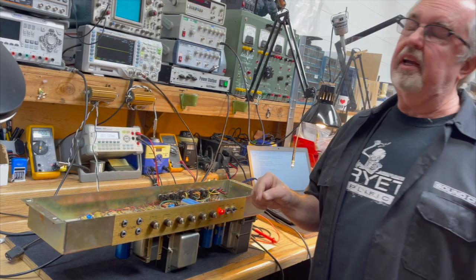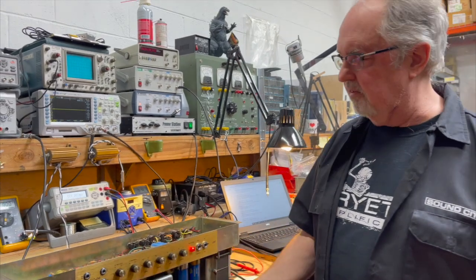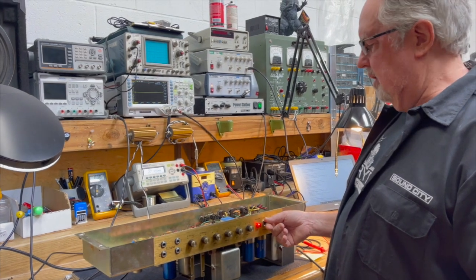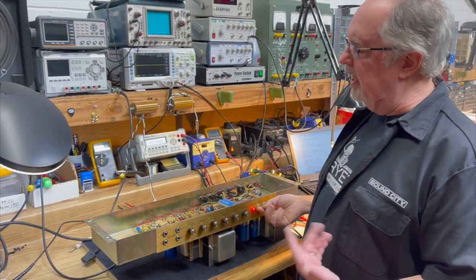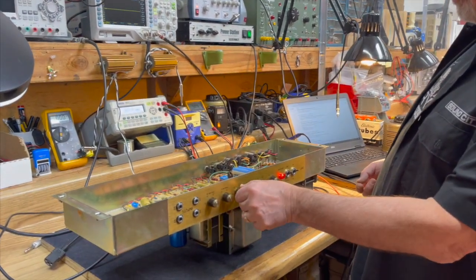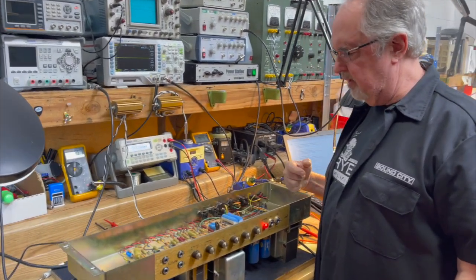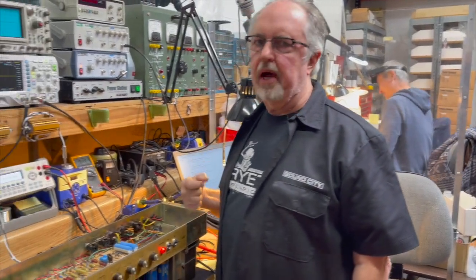So you're still going to hear some hum, no matter whether it's regulators dropping out or power supply ripple bleeding into the signal stages. There isn't anything getting around that. Pick your poison. And cellular noise pollution. Yeah, and so when we do the show, we'll play through these so you can hear how they sound. But this is what we've got when we're cranking things to try to get saturation. So you're going to deal with noise one way or the other. Rock and roll is noisy. But now what we're going to do is we're going to experiment with the power tubes.